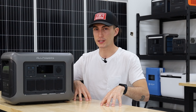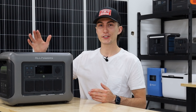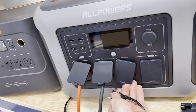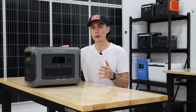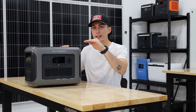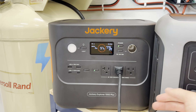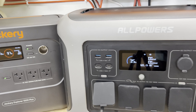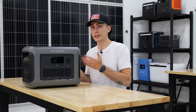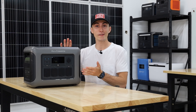After charging, we went back to revisit the efficiency test. I plugged my meter into one of the sockets and it showed only 108 volts — which was kind of my suspicion. If you put a different power station right beside it and plug the same load into both, this one reads about 1500 watts while the other reads just over 1800 watts, because it's limiting the voltage. So instead of outputting 120 volts, it's only outputting 108. You can even hear it — when you plug a heat gun into this it sounds a little lower than when you plug it into a different power station.